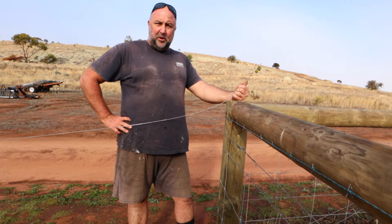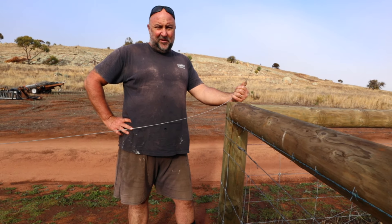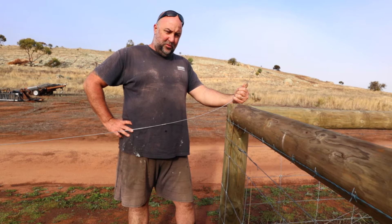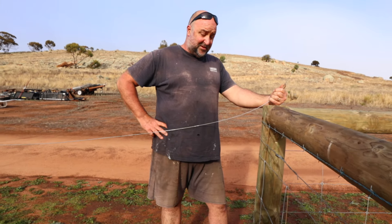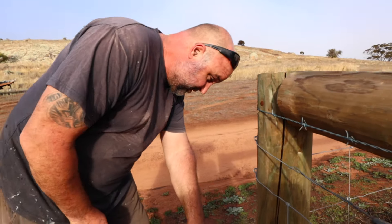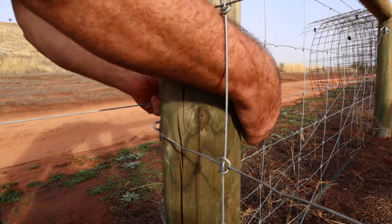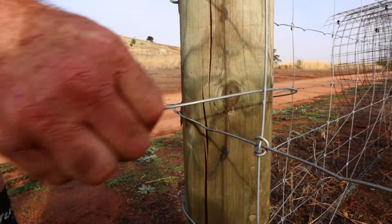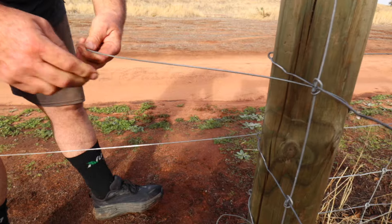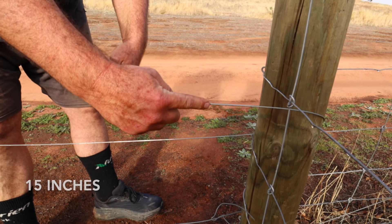Another thing — because we're all about safety at Rockpile — you should put some glasses on, because the wire can get quite flingy if you're not in control of the end and you don't want the wire coming in there. I'm just going around these for now because later I'll bring some insulators off the inside here — I just want to put them around there so it's not all loose and hanging in the breeze. This is the earth wire; we're just going to tie it off to the fence.